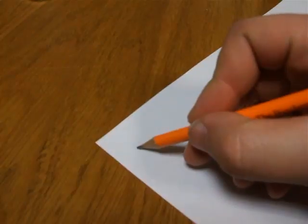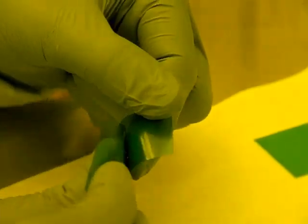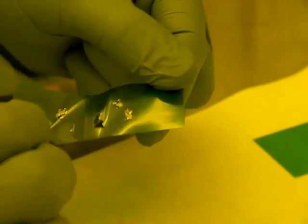We need to remember that the binding between the planes is very weak in the case of graphite — that's why you can write with a graphite pencil. So why can't you just use the scotch tape method for all applications? As you've seen, the scotch tape produces small flakes. These flakes have very high electronic quality, but it's not suitable for mass production — you wouldn't want hundreds of people in a facility taking off graphite by hand. So that material is utilized for prototype devices and basic physics applications.